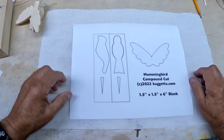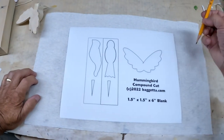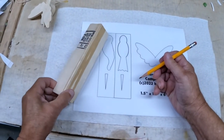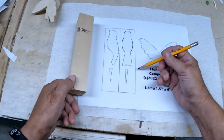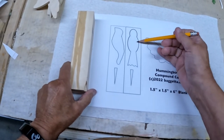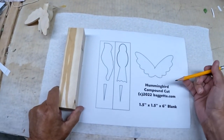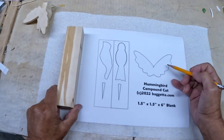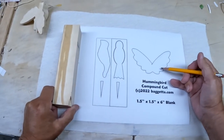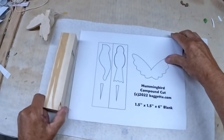Here's the pattern for it, and it's going to be up on my page which you can get to by clicking on the link below. What you're going to need is a blank — in my case I cut it from a two by four, it's one and a half inches by one and a half inches, approximately six inches long. From that you're going to cut the body of the bird out, and also the beak, which will be cut from a piece of one quarter inch birch plywood. You could make it thinner if you want, go to one eighth or some other size too.